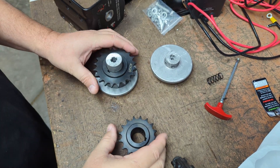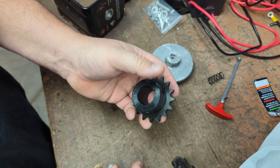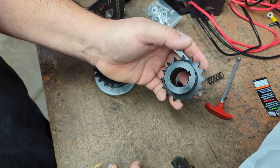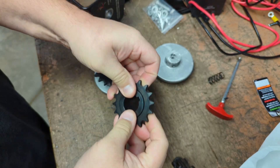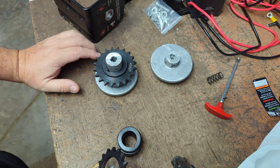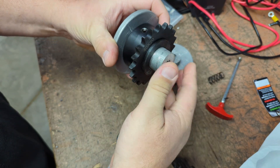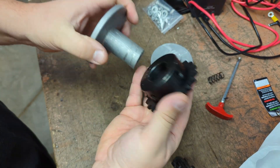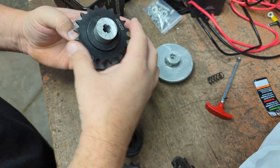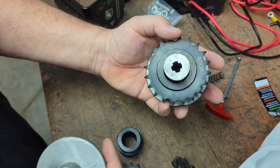This is as much reduction as I can get. The shaft for the handle of the trailer is 1.2 inches-ish, so I'm going to have to bore out this hub — that's alright. We're going to use a number 40 roller chain, which is more than big enough. This hub almost exactly fit at an inch and a quarter — it's almost the diameter of the drum. I might wrap a little tiny shim on there to take up the last bit of slop.